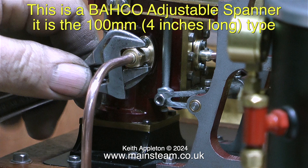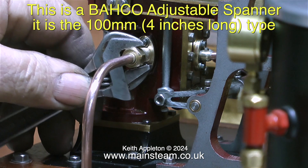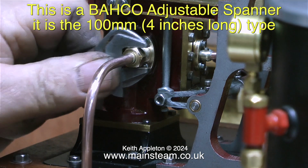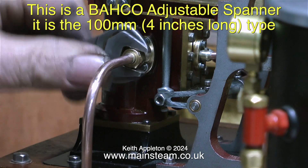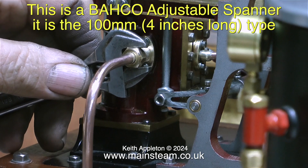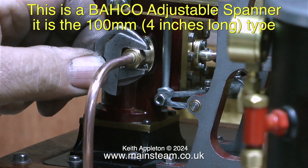About 35 years ago I bought this Bahco adjustable spanner, and here I'm showing how I use it. You'll notice that I frequently rotate the screw that adjusts the jaws to make sure they apply even pressure squarely onto the nut. If you use a Bahco spanner like this and keep it tight on the nuts, you will find that it will never round them.